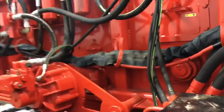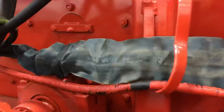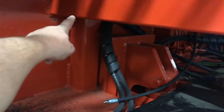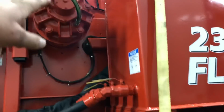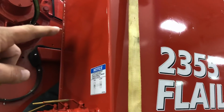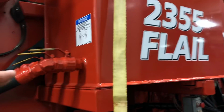So we got the feed wheel back here, and then you got grease zerks on your bearing here. What we're gonna do is I'm gonna run those two, that one, 3 of those will come down here. We'll put a junction all along here. I already got 1 hose run, 2 are ready to put on. The bearing for this, that's that hose right there that I already made. The bearing that holds the shaft for that, there's 2 grease zerks up there. Those will shoot down back over here too.